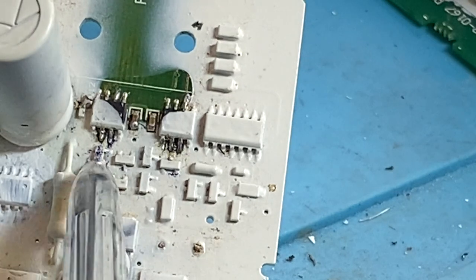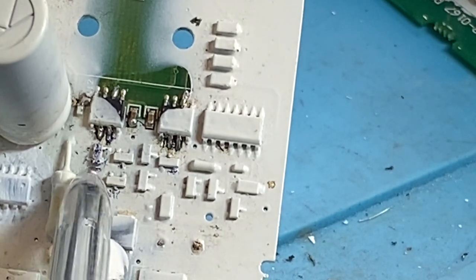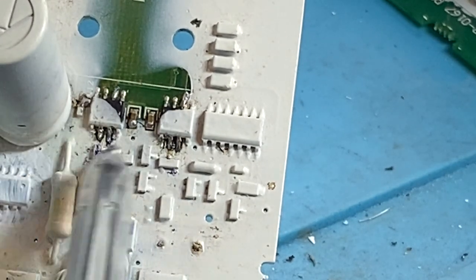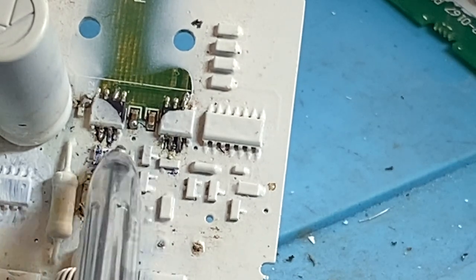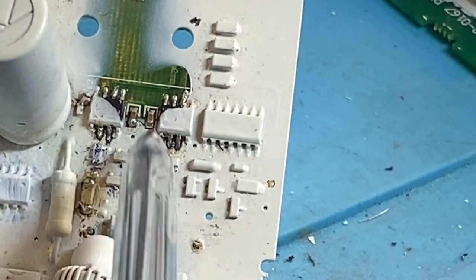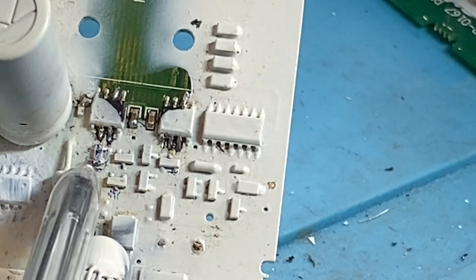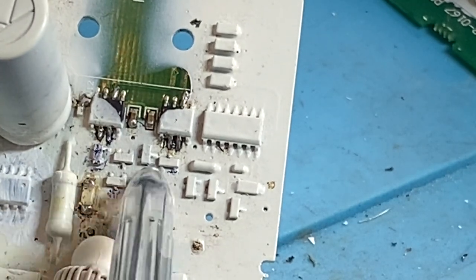So they use this. And by using the dual gate arrangement, it also reduces a parasitic capacitance effect called Miller effect, which is very problematic in wideband high-speed amplifiers. And these are set up as high-speed wideband amplifiers. Basically, there's no filtering. They'll suck in anything. The only thing that limits the amplification, whatever high frequency you shove up there, is just the parasitic capacitance of the design itself. And you don't want parasitic capacitance, it slows things down. So it's a vast improvement over just dumping a 33k ohm resistor to ground, what they used to do in the old designs in the SDs.